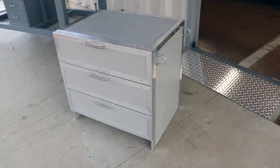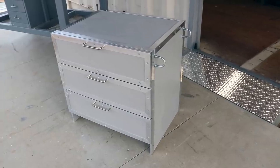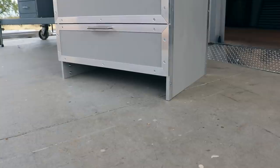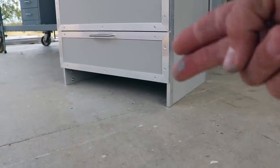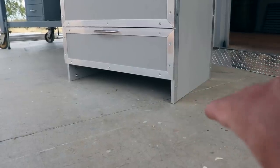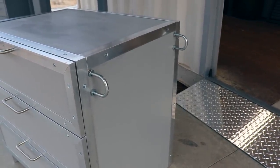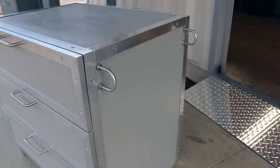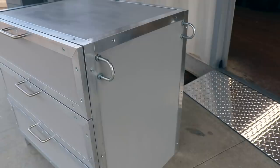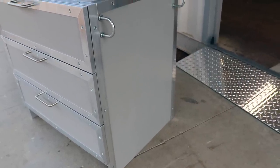At this point the cabinet is pretty much complete. I'll give you a quick walk around and talk to you about some of the features that might not be as apparent as the main storage cubbies are. Starting with the bottom of the cabinet, you'll notice there's a small gap down there — that is because this cabinet is going to sit in the back of Tristan's SUV right next to where his sleeping pad is. The gap will allow that bottom door to be accessed when the sleeping pad is in place and will also give him some tuck-away storage underneath the cabinet for slippers, clothes, or whatever else he wants to store in there. Moving up to this side, there are two U-bolts that will serve as attachment points for a dirty clothes bag, a trash bag, or whatever else he wants to add there. He makes quite a few vehicle travel accessories, so I'm sure he might come up with something creative to put there. And this open space down there will be available in case he ever wants to put a flip-out table or something like that.